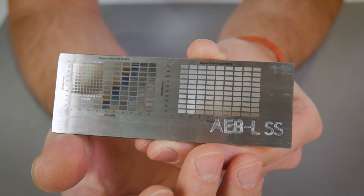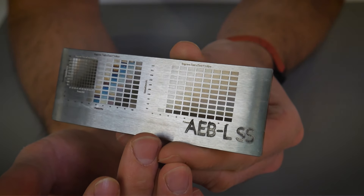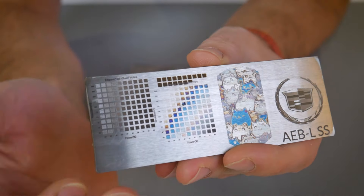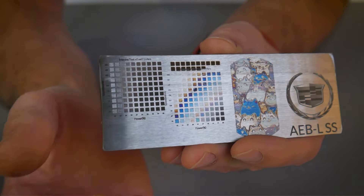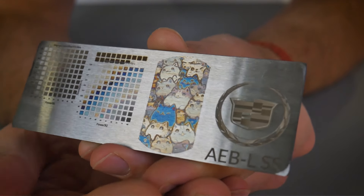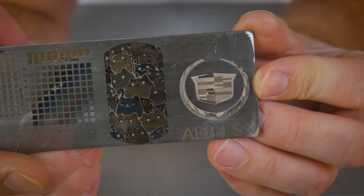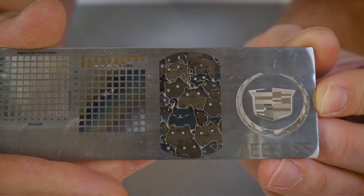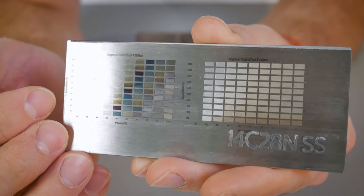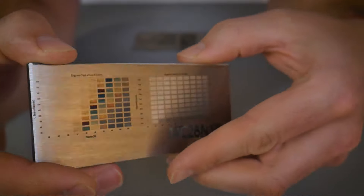Now we'll look at all the engraving samples under better lighting conditions. With the AEBL stainless steel, you can more clearly see the various colors from the blue light laser test array, as well as the initial IR laser test results. On the back side, there's a much more vibrant and complete spectrum of colors from the narrowed-down power and speed settings. Using the tighter settings from that material test array, you can better see the colors achieved in the cat design — though some colors show up better than others, and consistency with the blue laser requires a lot of experimentation. The IR laser gives much more consistency across different materials, and the 14C28N results are almost identical to the AEBL with the IR laser.